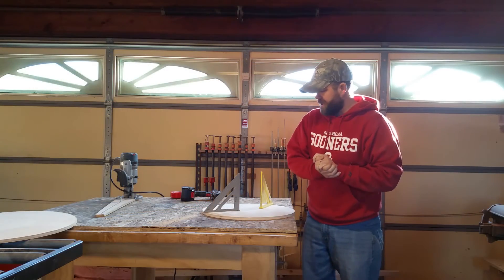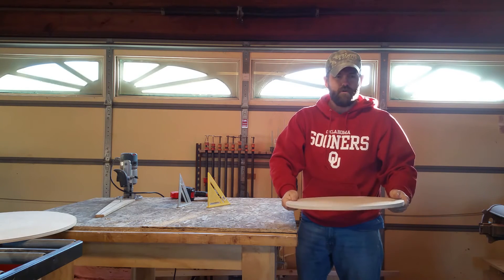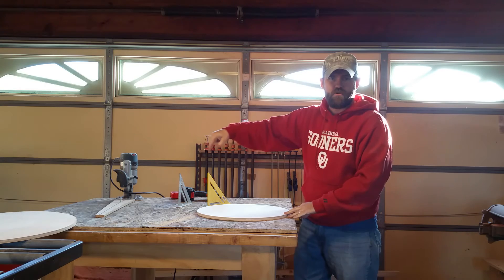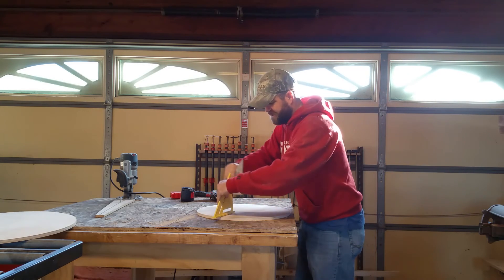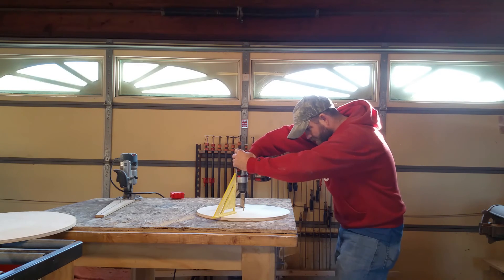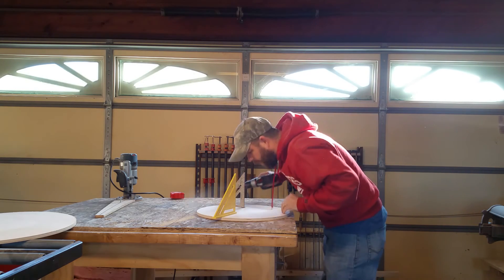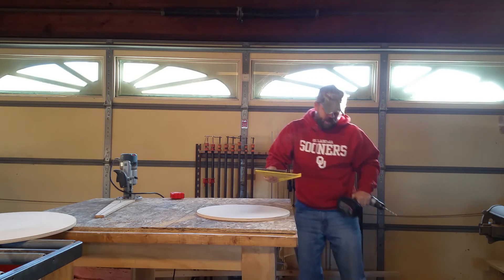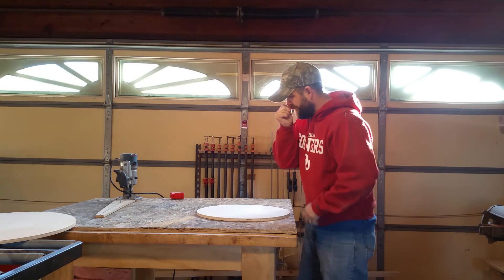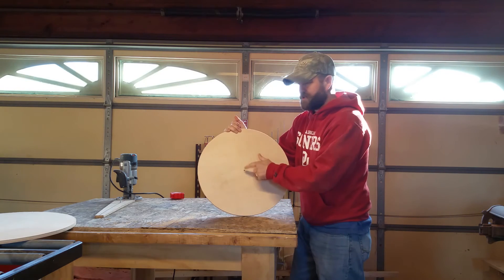Back to the mirror box cover. I cut out my circle that's going to fit over the hole cut out on the mirror box. Now I need to drill the quarter-inch hole in the middle because I'm going to use my circle cutting jig that I made for the router. I use a couple of speed squares to keep myself as vertical as possible. I've got that divot left with my compass. Now I have my hole. I'll pick my best side to be the top, and if there's any tearout on the sides, that'll be the side used for underneath. Of course we'll have a knob or something that goes in the middle.